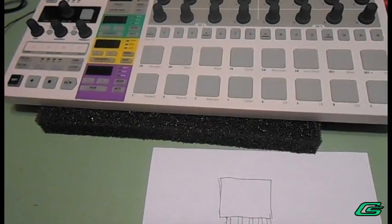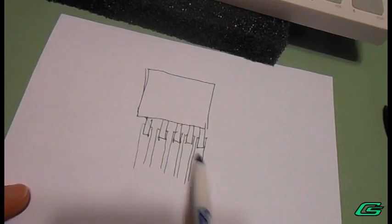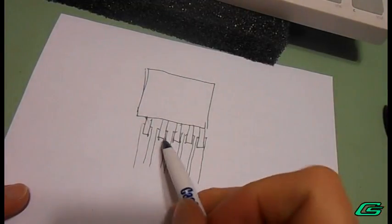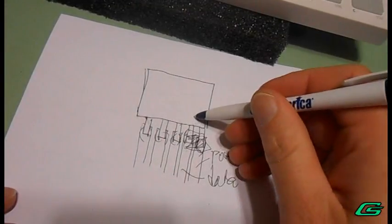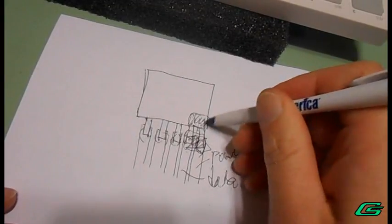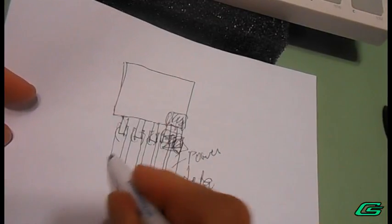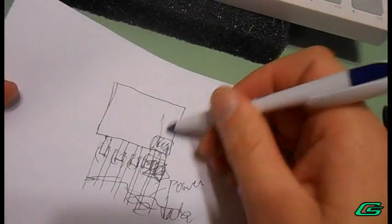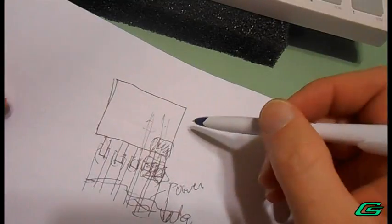The traces have bridged themselves again. Here's my new USB connector and here are the tracks. The bridging ran away from me into an area where I couldn't get to it — I had to tear this off again, and these traces just got torn apart. I even ruined my connector; it pulled some of the leads out of the USB connector.